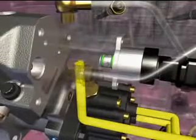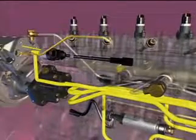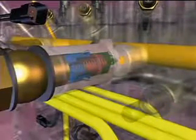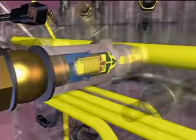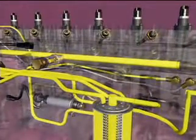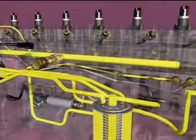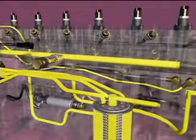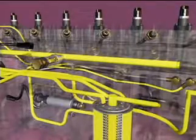Because the actuator is a normally open valve, any circuit problem, such as an inadvertently disconnected actuator wire, will cause the actuator to open. This results in maximum flow to the high-pressure pump, leading to opening of the fuel rail pressure relief valve. This valve protects the rail, lines, and injectors from any malfunction causing overpressurization. When the fuel in the rail exceeds the valve setting, the valve opens and fuel is returned to drain.